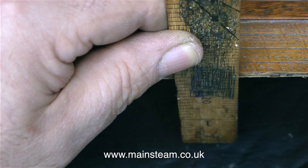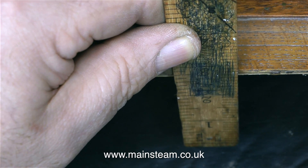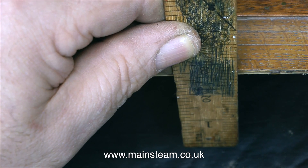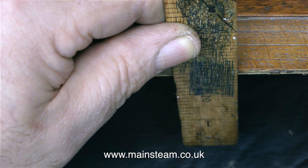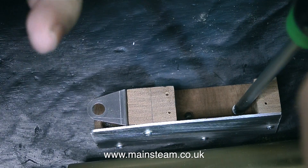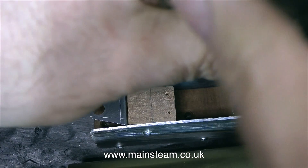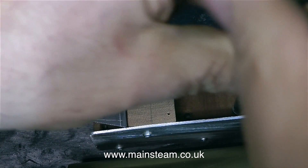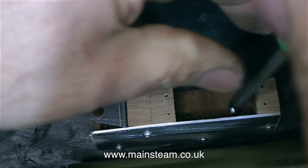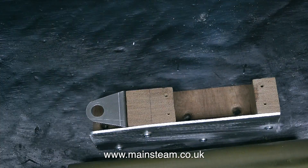What I'm doing at the moment — using a really old school type ruler, mainly because it's more visible than the metal one, even though somebody's scribbled on it — is measuring the distance from the decking down to where the servo is, to make sure that when I fit the top superstructure, which goes well down into the hull, it's not going to foul the servo. The good news is it's not going to foul the servo. So now I know that, I'm removing the fitting from the boat because I need to paint it.